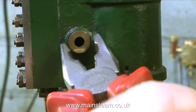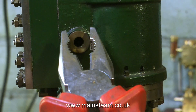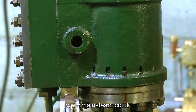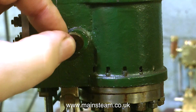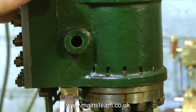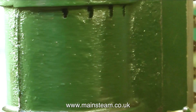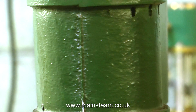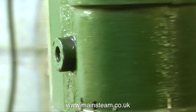At this point I'd better add a health and safety notice: I cannot, under any circumstances, recommend DIY dentistry in the workshop environment. Anyway, back to the engine. The exhaust was even worse — this bush was very, very shallow, it just fell out. And then I realised what had gone on. I'm pretty sure that the builder was supposed to drill these holes tapping size for 3/8 by 32 threads per inch, and I think he got a bit confused and drilled the hole 3/8 of an inch. So instead of fixing it, he just put a brass plug in. I may be wrong on this, because I don't have a drawing for this engine. It's something that I would have done in my early years.